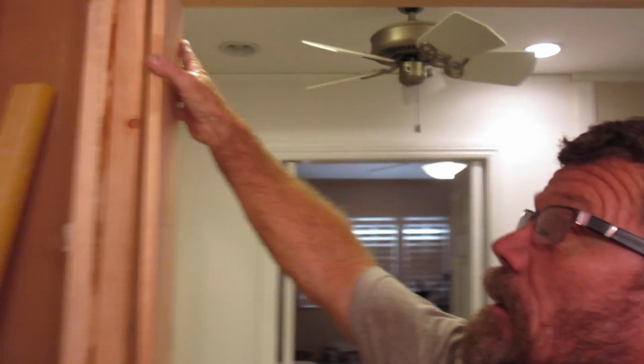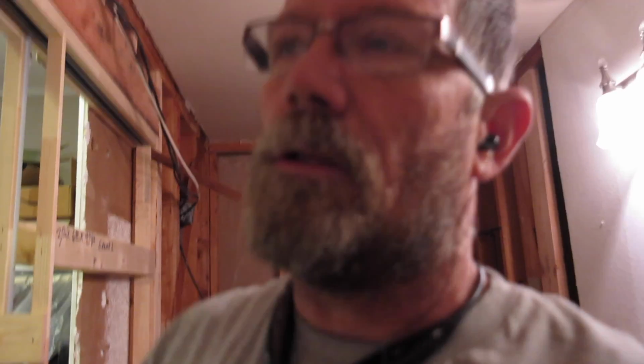Okay, the other issue is plumb this way, of course. We're sort of limited. We have to go with the existing wall. If it's not perfectly plumb, and it's not because it's in this fallen world we live in, the door might not be perfectly plumb, but the beautiful thing about a pocket door is it kind of swings, and you set the guide at the bottom so it fits in there, and you can't really see that it's out, and it's not that critical.